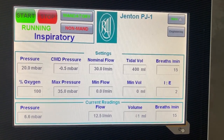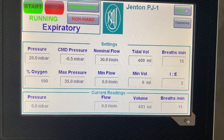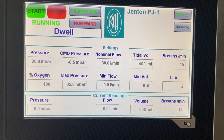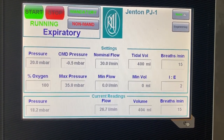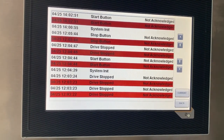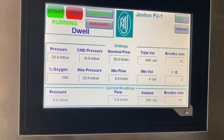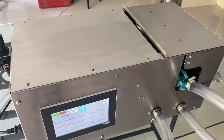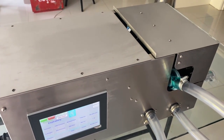Whatever mode is in operation, the actual flow and back pressure is monitored and if any value exceeds the preset threshold, an alarm is set alerting the clinician. All alarms as well as mode changes and on and off occurrences are stored with a date and time stamp. The last 1500 alarm conditions are stored and cannot be erased.